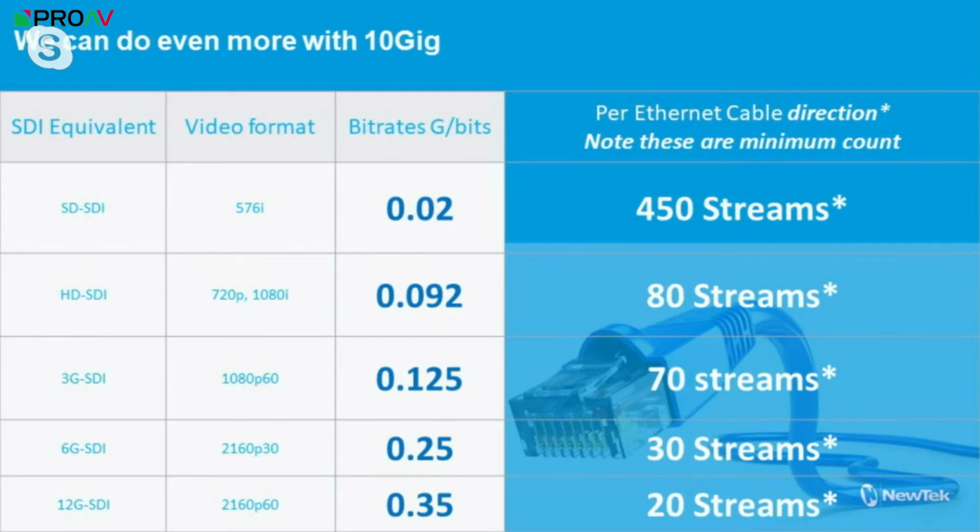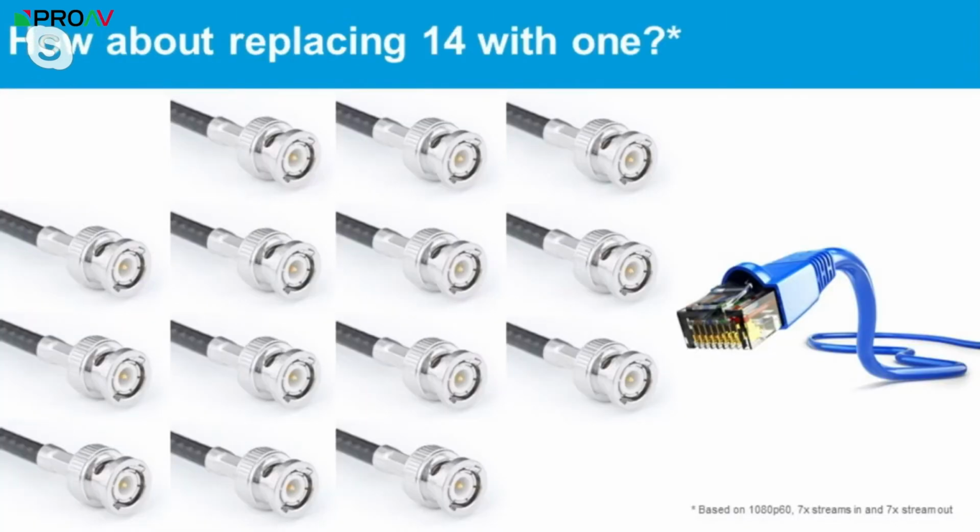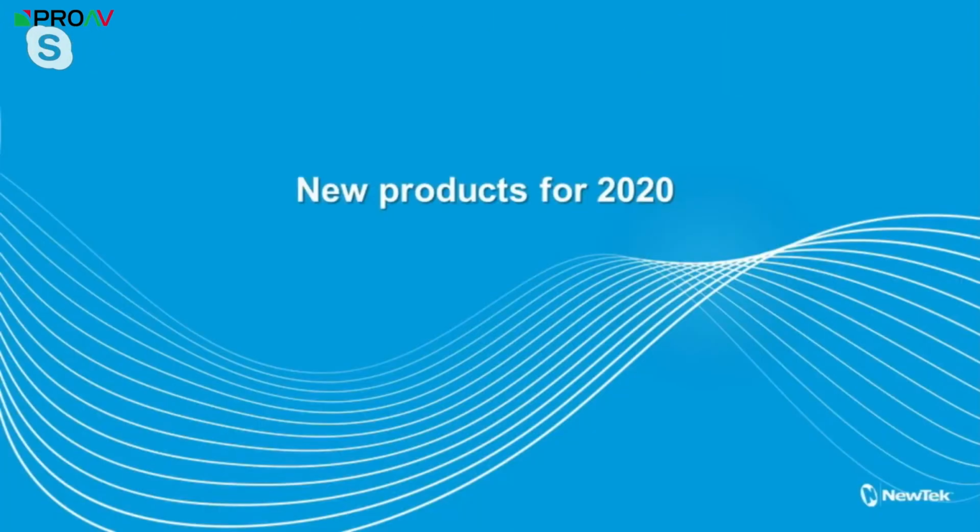If you use a 10 gig network, you're going to get 10 times that amount, because we're not going to change the data rate, we're just going to give you more scale. And at this sort of level, you can end up with an insane number of streams that you can utilize and start bringing around on any scale of infrastructure you want to choose. In summary though, all of this means that we can do the job of 14 3G SDI cables on a single link, and even more so depending on how you want to deploy that as well.